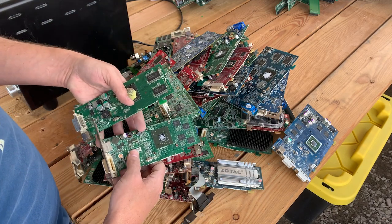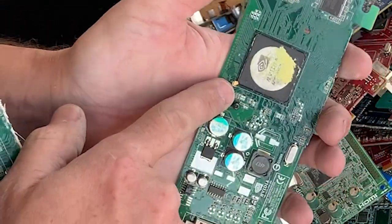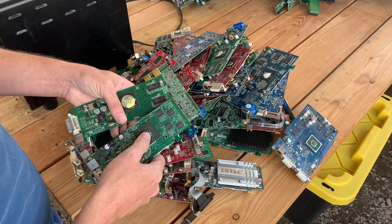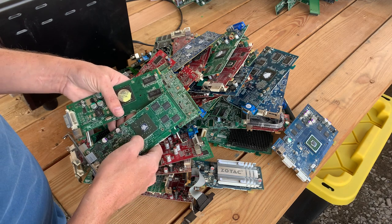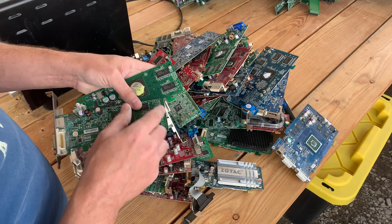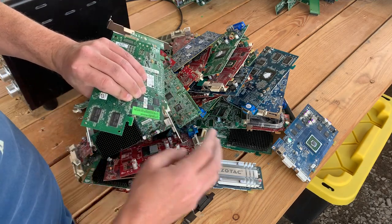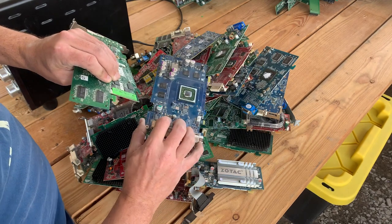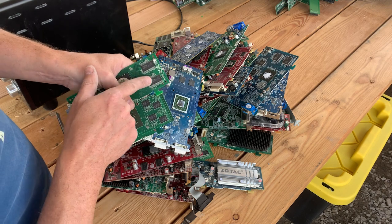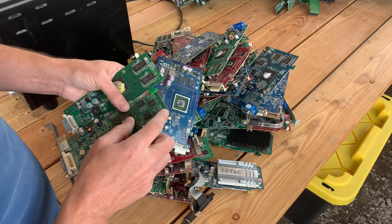What I'm after here are the chips. This is the best chip right here — it's a little bit dirty and hard to see, but it's got that gold corner. These chips right here are practically useless. They're BGA-styled but there's really nothing you can do to get to the bonds on the inside with any reasonable amount of effort. Then you've got the RAM — sometimes they're double-sided as both of these are, but sometimes single-sided. The RAM IC chips have your flat pack ones with legs and your BGA style.